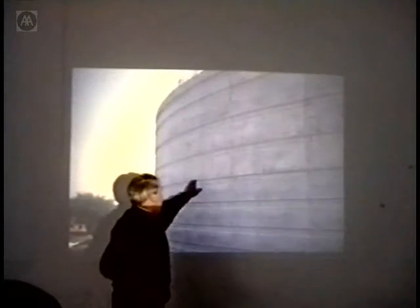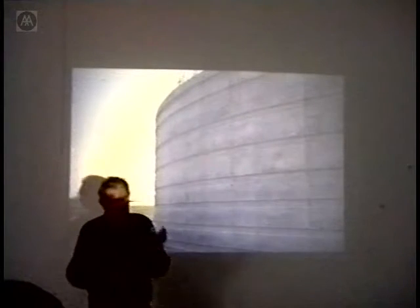Now, since the bit in the groove each time is going to be covered with a high-strength mortar to protect the steel against corrosion, the remaining parts are left exposed, and therefore you see them. And there was quite a problem about the variation in colour in the concrete, because this was supposed to be a finished material and everyone wanted it to look as they expected, fairly light and fairly uniform colour. And sadly it was not quite like that.